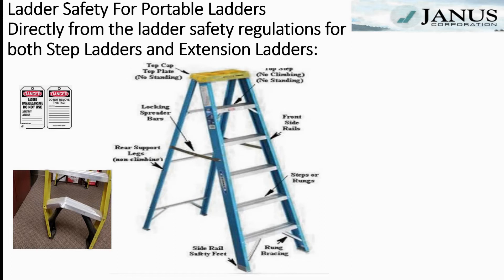On a step ladder, the feet are set in place and do not bend or move like they would on an extension ladder. We check that the steps and climbing rails are all connected solidly to both rails. Both rear support rails should be connected solidly to each other with solid bracings. When the ladder is in use, the locking spreader bar must be locked into the fully open position, assuring the rails are at the proper angle to support the weight of the work taking place on the ladder.